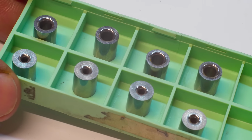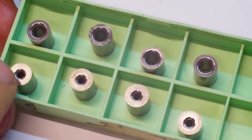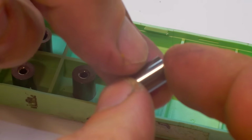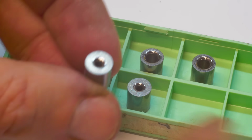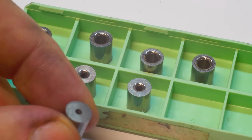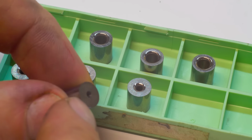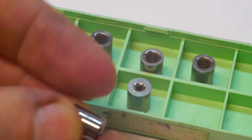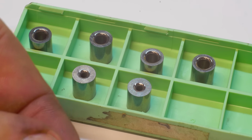These are all 8 of the carbide bushings with the lead-in radius. I ground to dimension. I ground the overall length off camera on the surface grinder, just putting them in a V-block and grinding the backside until the right length was achieved. The last step, which I'm also doing off camera, putting back in the lathe and just rounding the backside over with a ruby stone a tiny bit. So just so there is no sharp edge anymore.